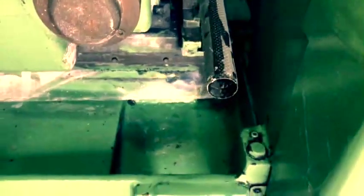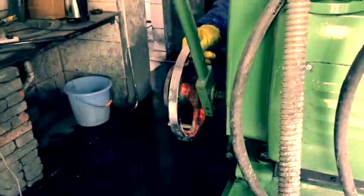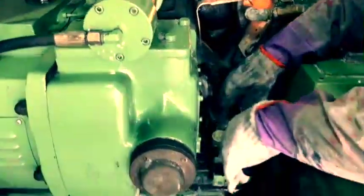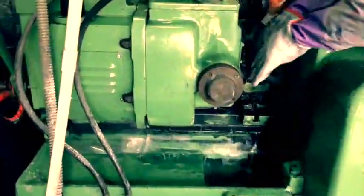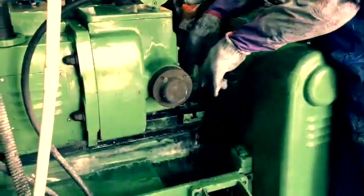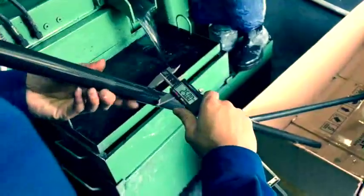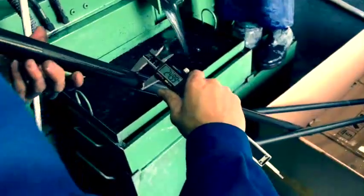Those fine lines are made of resin, which is relatively soft, and they need to be removed for a professional waterfed pole. That means using a precision sanding machine to sand those fine lines off and get the perfect surface for a clamp to grip on. With REACHIT, we sand the outside diameter of every tube to within one hundredth of a millimeter — that's one twenty-five hundredth of an inch — giving us a beautiful smooth finish and a long-lasting, non-wearing waterfed pole.